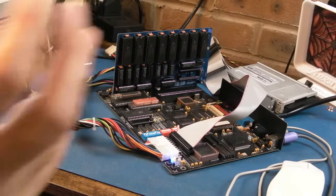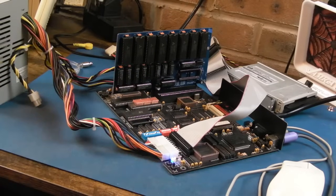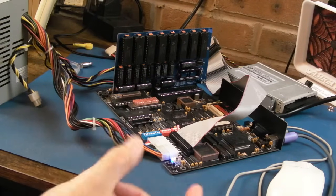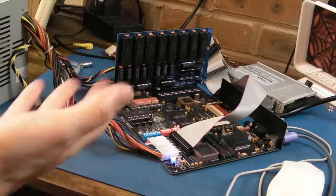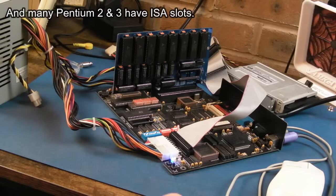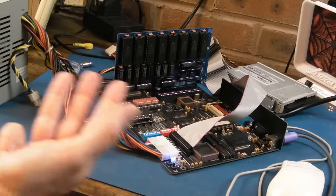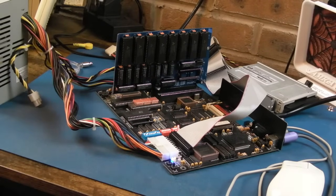But if you're going to go into DOS gaming and stuff, you're better off with something a bit more beefy. This is why I went straight to a Pentium 2, actually. Some people prefer the Pentium 3, because you can use software to slow down the processor to get compatibility with older games, and that's what I do on that. I use something called AT Slow, and then just give it a number. It basically adds wait states in at various points in the processor, and everything just runs perfectly on it. Doesn't matter what I run on it. And of course, with something like a Pentium 2 or a Pentium 3, you've got 486 stuff, 386, 286, and XT. And provided you've got the capability to slow down there, you've got the best of everything, really.